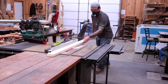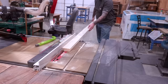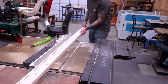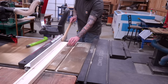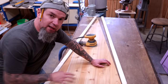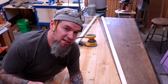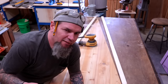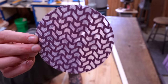Now that we have our two trees assembled let's start cutting our trim. For the side and bottom trim I'll be using a two by four. I'll start off by cutting off the rounded edge so I can have a flat surface to work with, then rip the two by four down into five eighths strips. Each tree will take a full size strip on each edge and a half strip on the bottom. Now that our strips are cut we need to sand everything down, get the sides stained whatever color you'd like, and put this thing together. For the sanding I'm going to be using a disc I've used for a long time but haven't mentioned much.